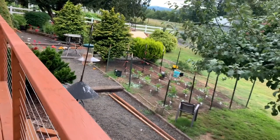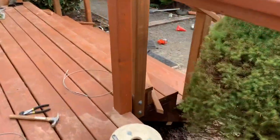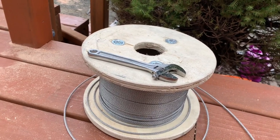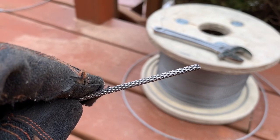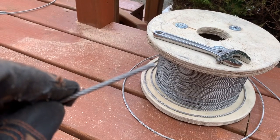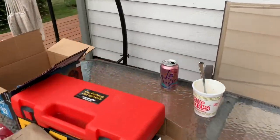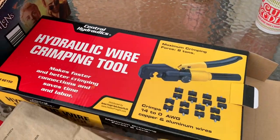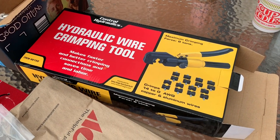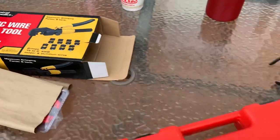I'm still in the process of tightening them all down and cutting off the slack. Besides that hardware, of course you need your stainless steel cable. My deck is pretty large so we got about a thousand feet of it, and this is a 7x19. For the crimping tool, I'm using this one from Harbor Freight — it does eight tons. Everything I found online wanted you to buy a 12-ton hydraulic swaging tool for about $120. I was not going to spend that. Found this at Harbor Freight, regular price was $59.99, and I used a 25% off coupon, so I got it pretty cheap. Pretty happy with it — works just fine.